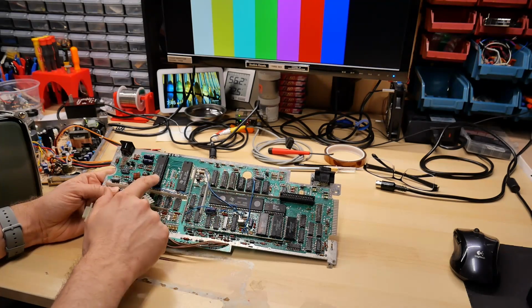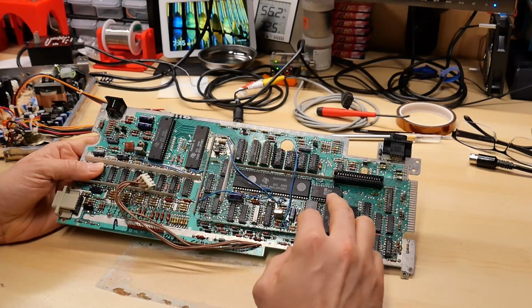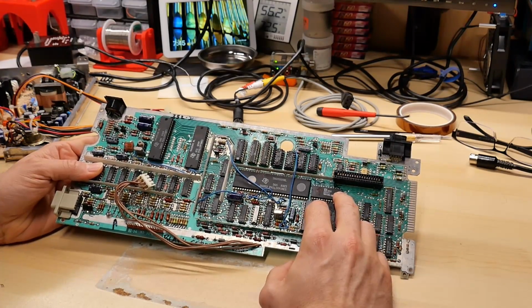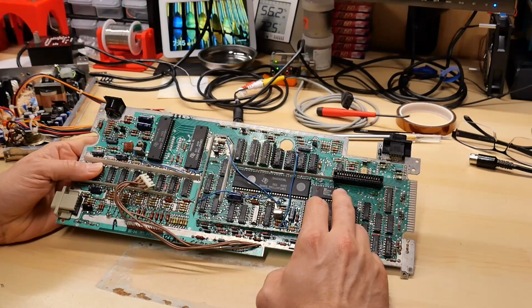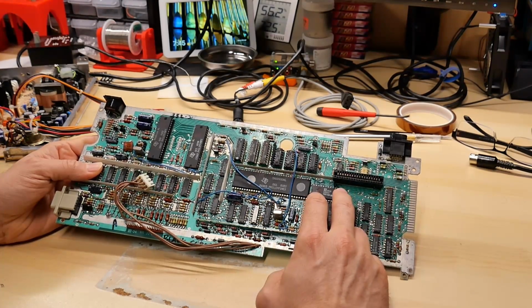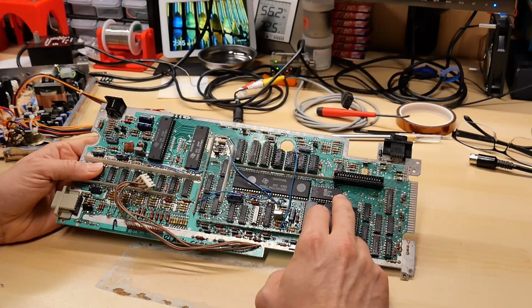So far, I have socketed both ROM chips, both of the SRAM chips, these 3 8 to 16-bit bus converters, and of course the video chip was already in the socket, as were the GROMs. In the last part, I confirmed that the 2 ROMs do read properly, at least in the TL866 MiniPro. Using some adapters I made, I actually successfully read these in and compared them to ROMs I found on the internet, and they compare perfectly.